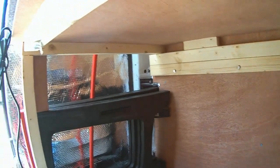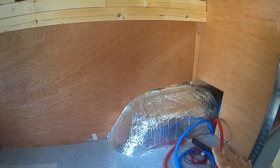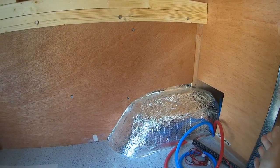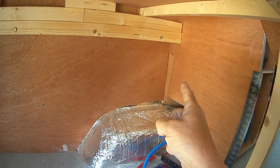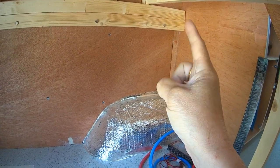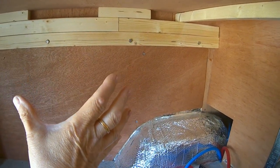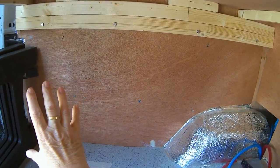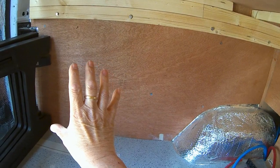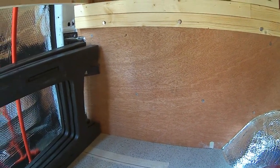My water system is going here — that's the back of the van, that's the left-hand wheel arch, and that's all going to be boxed in with some insulation. I've got my water pipes coming through the floor that go to my truma, my shower, toilet, etc. The water tank is going to be mounted here as an internal water tank. I'm putting my pressure vessel just there, my main pump just there, then the big fresh water tank there, and the five-stage reverse osmosis system on the wall. The remaining space will be left for a hose reel for connecting to on-site water supplies, and I'm thinking of putting a homemade filtration system there to gather rainwater from the roof — still deciding on that.